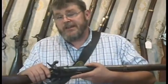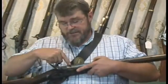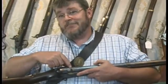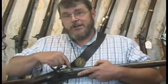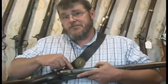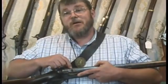I want you to remember that. And the nipple or the cone put directly on top of this handmade barrel. If you've done it right, you've gone through the threaded piece of the breech. This is the rear section of the barrel. There's a plug here that's threaded, and hopefully you've got the strength of that wall.